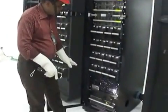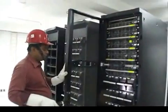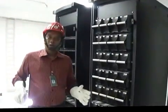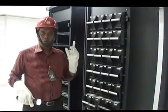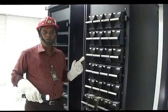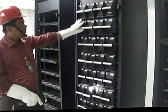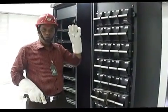Here is the total battery power unit system. This is the main UPS. It also has display units. As I said earlier, our total power system has full load, one hour backup — that means 40 KVA full load, one hour backup. Here is the battery unit, and each battery unit has 32 battery parts in this cabinet.